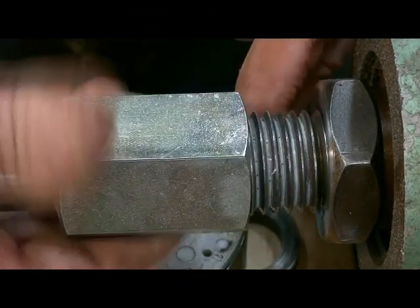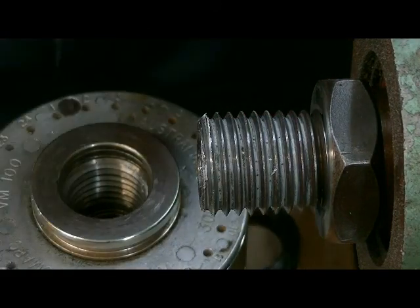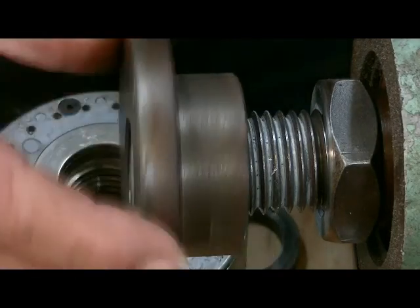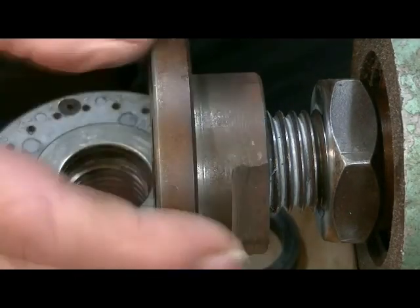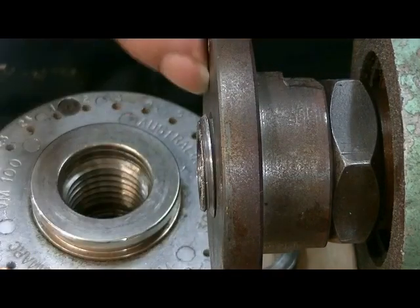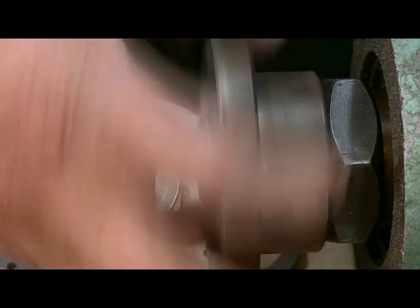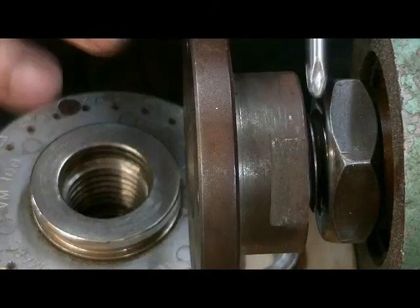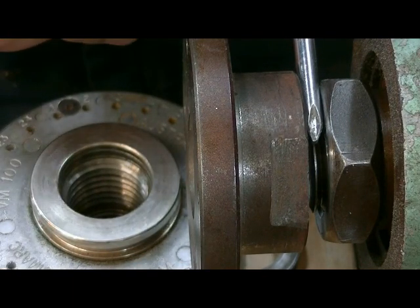The other case where you may need a washer is where you have a thin face plate and the nose sticks out through it. So again you need a solid steel washer between the face plate and spindle to hold it straight.